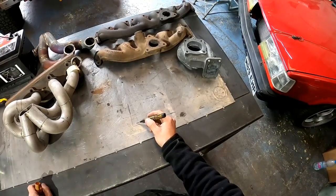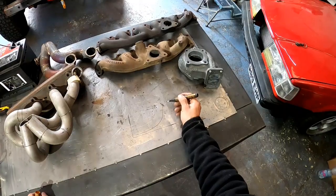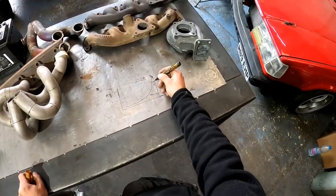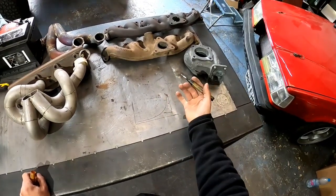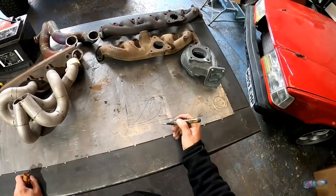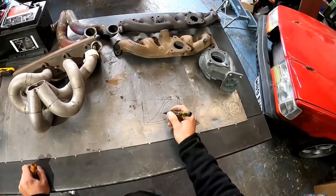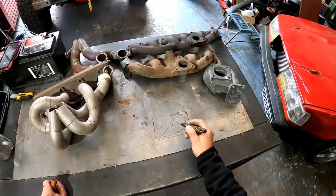So before it was building up, building up, building up. Oh, 700 brake horsepower, and you hold it for like, I don't know, a couple hundred RPM. This is useless, because this is what you're playing with. You have to keep the engine in this area. All of this is empty. Now once we'd done it, we were able to see something like this, okay? And you have all this area to play with. This is completely different. This way the engine feels much more powerful, with much more torque, and it's drivable, okay? And the engine lives better.